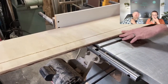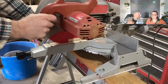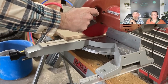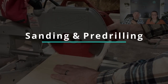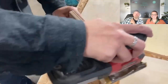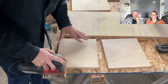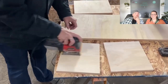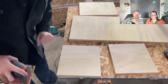Just cutting out the length and size and squaring up the ends to make sure everything's straight before you start to put everything together. After we get everything squared and cut, the next thing is sanding - my lovely wife was the super sander. A lot easier to sand these all now before you get them assembled, that way you can get in the nooks and crannies while it's nice and flat. Just makes your life a lot easier.